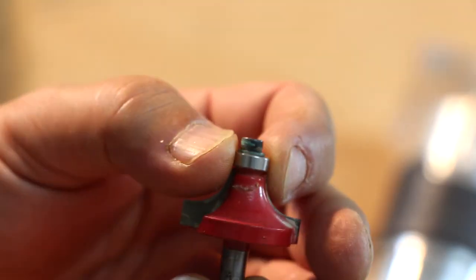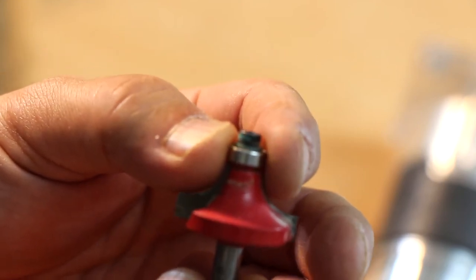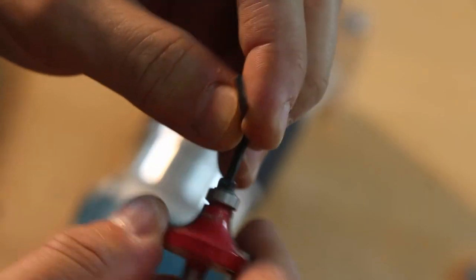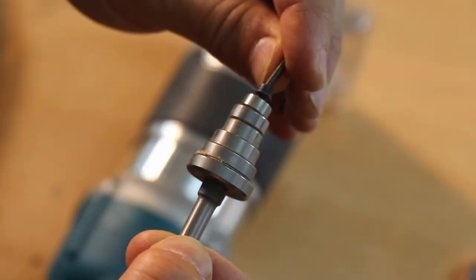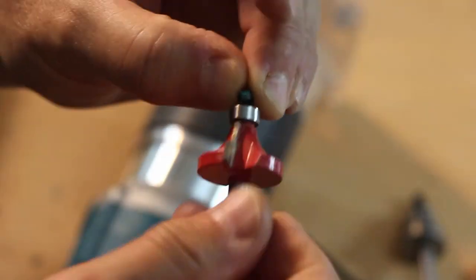A couple of things to look for when setting up your bit and router or trimmer. First, check for the integrity of the ball bearing. This one came with a cheap Chinese set — I think the whole set was under $20, so my expectations weren't too high. But when you see a wobbly bearing, you do not want to use it anymore — you may damage your guitar. If the bearing is not firm and flush with the blade, the cutting will not be either. You can easily replace the bearing itself or just get a new bit. It's not a bad idea to have some spare bearings, or even borrow one from the same set — just make sure it has the same diameter.